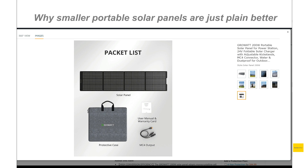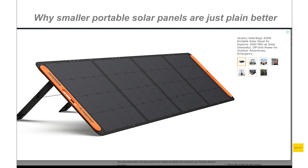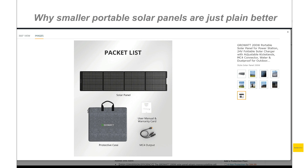The one thing about MC4 is it can be a little difficult to disconnect. That's kind of where Jackery has a slight advantage. A lot of people talk negatively about Jackery using their proprietary 8mm connectors - especially now with the thick-pin 8mm connectors - but these things plug in and out super fast. You can set the panels up and unplug them really easily. Jackery also has a really good low and wide 200 watt panel design, though the Jackery stuff is super expensive.